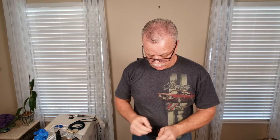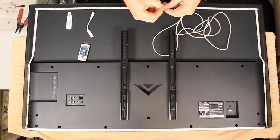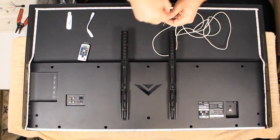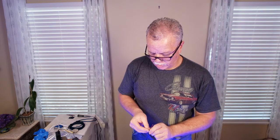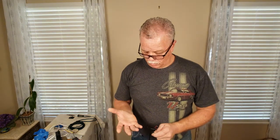Now we're going to go ahead and test the LED lights to make sure they're all working. Make sure I got a green light — good. I got a red light — good. And I got a blue light — beautiful. Again, if green and blue were touching, that's the color we get — kind of teal. If red and blue — you get a pinkish. So then we know we have a short there.